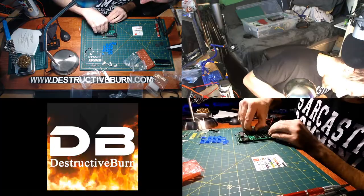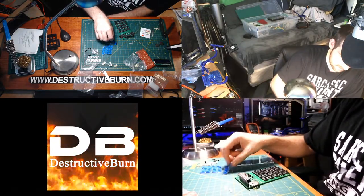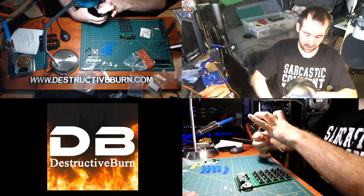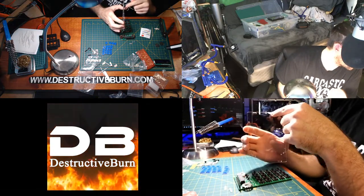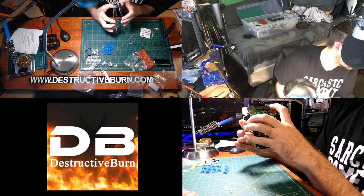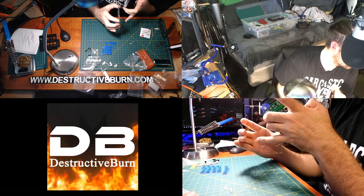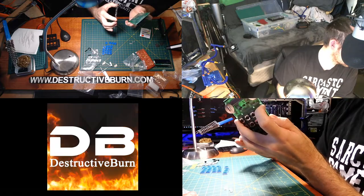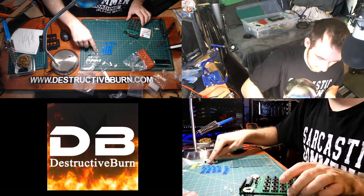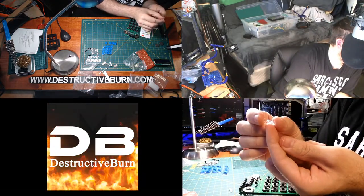It would be best to put the buttons on before putting this onto the acrylic. Push it down and it should click into place. The next part is mounting the board onto the transparent acrylic. There's a hole up here and another hole off to the side. The board has matching holes — five spots total to fill with screws coming up from the bottom, transparent spacers, and then nuts on top.